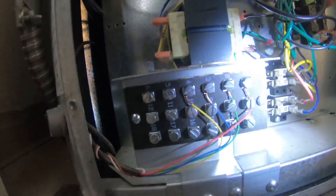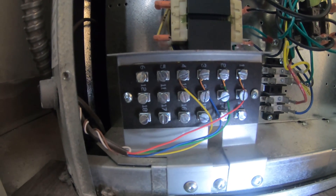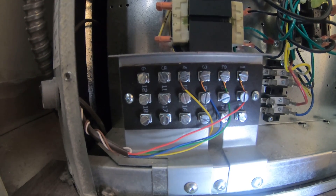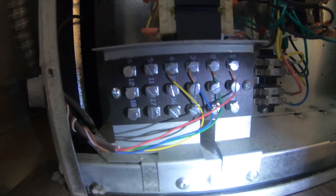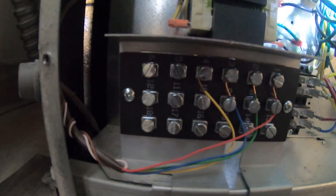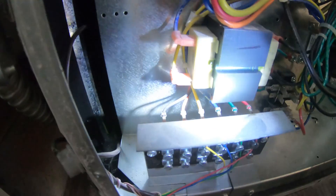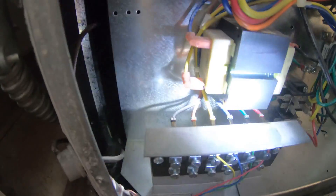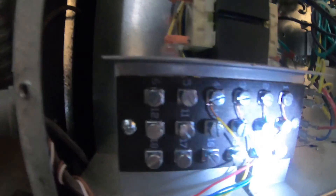For today we're just doing the basic install of the thermostat with batteries as the main source of power. Someone asked: how do you know which wire is which? In the installation manual of your thermostat you're going to see labels like R, Y, W, C — that doesn't mean that's the color of the wire. It should be the color in a perfect world, but usually it's not. My red is my power; I know my red wire is my power because if I follow this block up, it's going to go to the transformer right here at the red block. Over here behind this I've got a black wire — that's my common because that's the other end coming off my transformer.